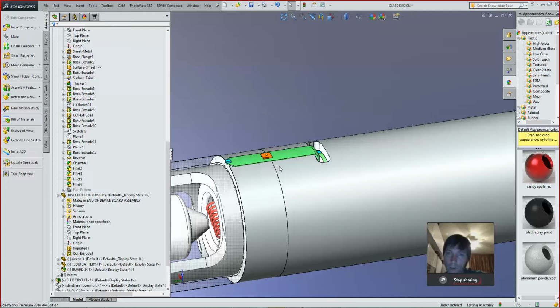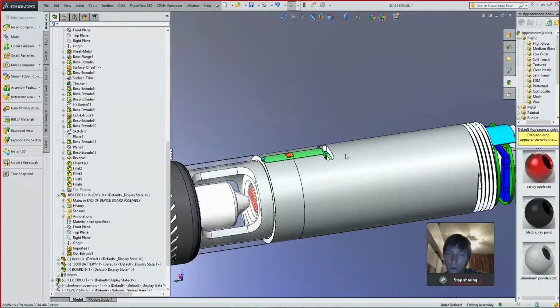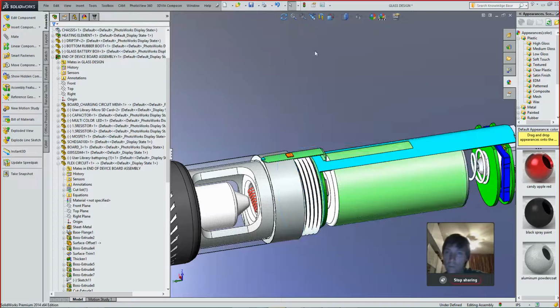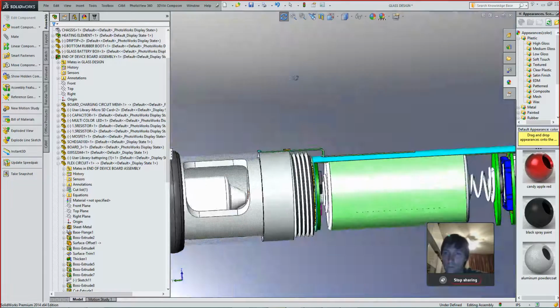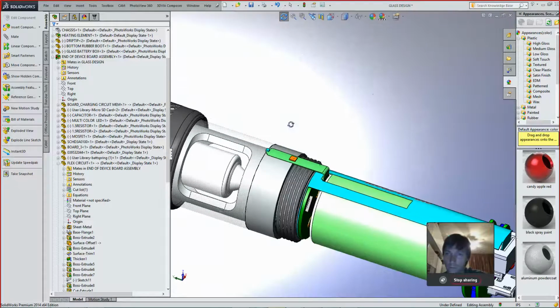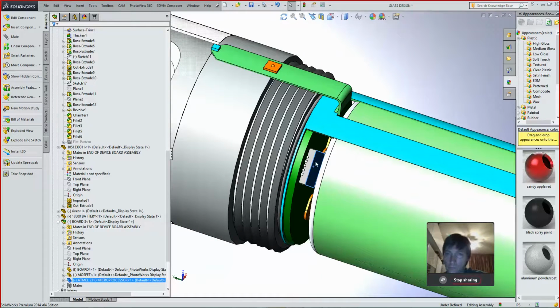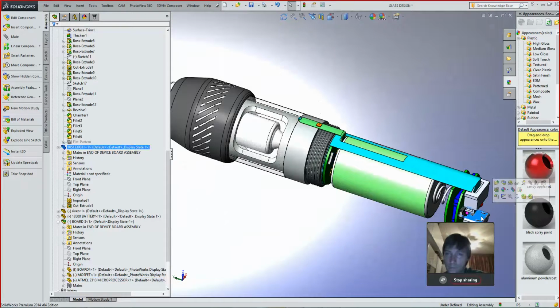Okay. And that's just tapping between that. That's our low voltage or control portion of the circuit. Okay. So then we want to be able to route things down onto the microprocessor here to be able to program it from the micro USB in the back. We want to be able to get through here, down here to be able to program that. And then that's going to flip the MOSFET on and off.